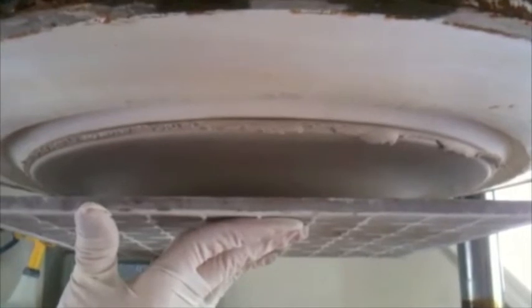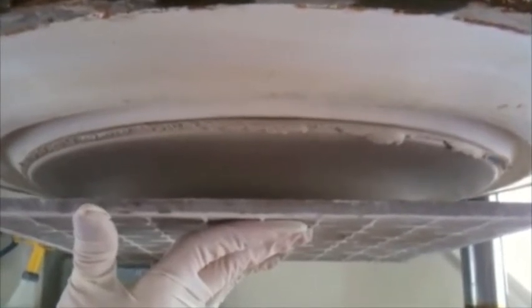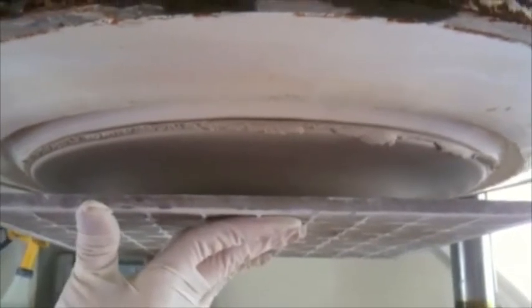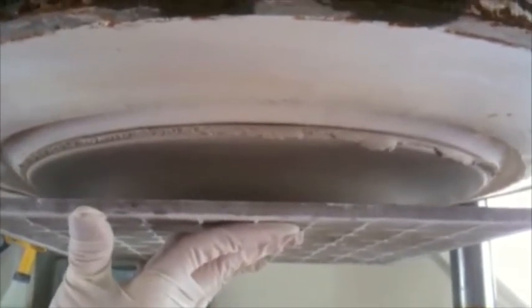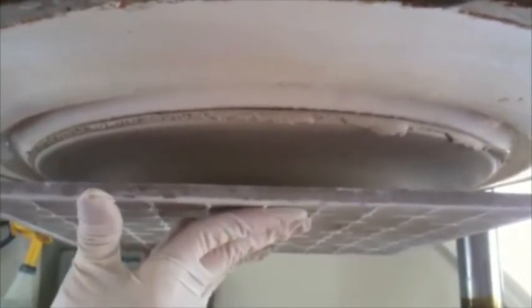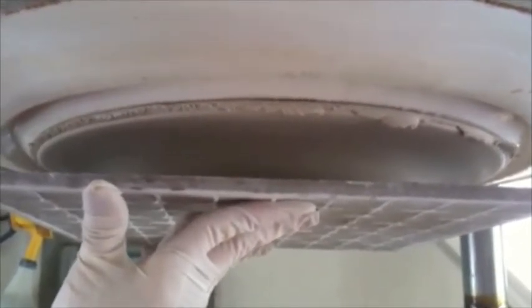It may not look like anything is happening here, but actually Lois is pressing a lever which uses an air compressor to pump air into the upper die, which pushes water out the porous surface of the mold. The water helps loosen the plate and eventually it falls down onto the waiting bat.